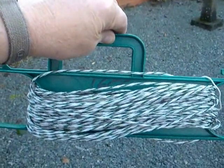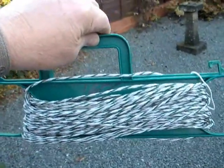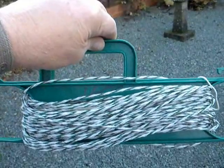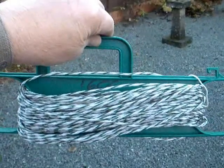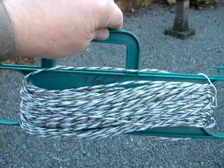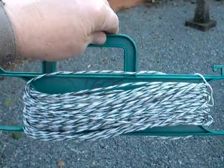So, I mean, you can use single wires. I often do myself. If I do use a single wire, which is very convenient sometimes, they're very quick and easy to put up, it will be 5/8 of a wave of wire, 5/8 wavelength long. In the case of 80 meters, that's 175 feet. I use 5/8 of a wave because you can then run against ground, and being mainly voltage fed, you don't need so many radials, and of course the radiating part of the aerial is well up in the air.